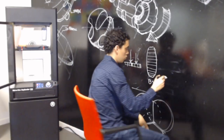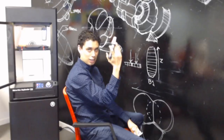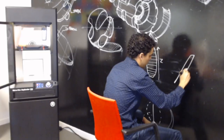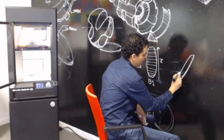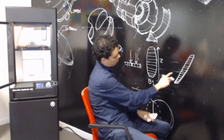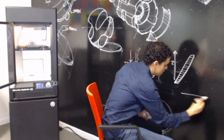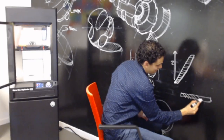And what happens when, instead, and this is our z-axis, we print it not entirely vertically, but starting to tilt a little bit? Simplifying it a little, printing it like that, now the layers are just a tiny bit shifted over. So if I turn it, this is my z-axis again, the layers are no longer parallel to each other, specifically when you put the board on its side. Once I put the board on its side, now the layer lines are slanted.